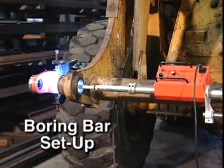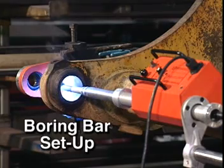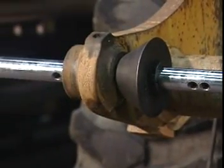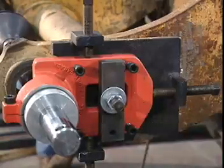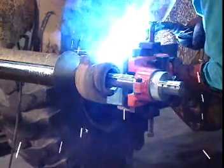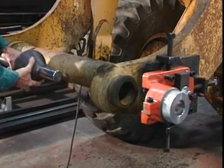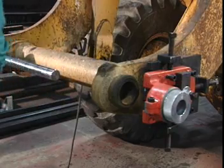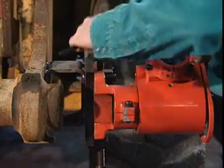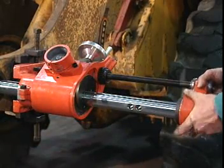Combining your Boa with a boring bar system leads to increased productivity in multiple weld applications. Setup is simple for a single operator. Centering cones allow the boring bar to be precisely positioned, or use the optional adjustable mounting plates. Once in place, the boring bar machine bases are tack welded to the workpiece. The cones are then loosened and removed with the boring bar. At this point, the setup plug is removed, the boring bar drive unit is installed, the bar is reinserted, and the axial feed arm is put into place.